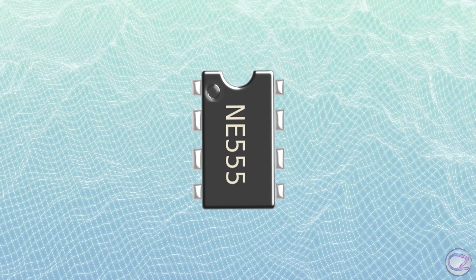See, it's an 8-pin IC. Let's learn how to number the pins. By using this technique, you can number all kinds of IC pins, so it's very important to know. First, you have to notice the notch of the IC. Then start counting from the left side of this notch: 1, 2, 3, 4, 5, 6, 7, and 8. Done. You have to count anti-clockwise.